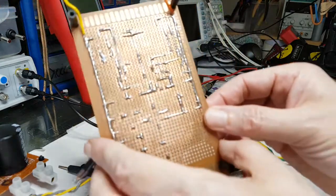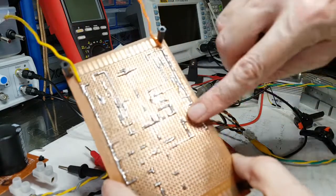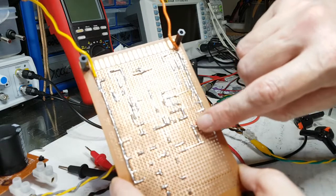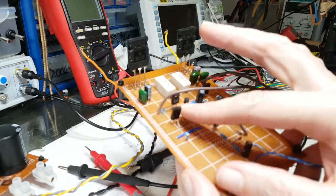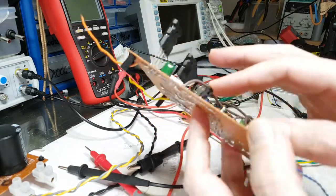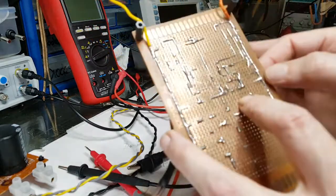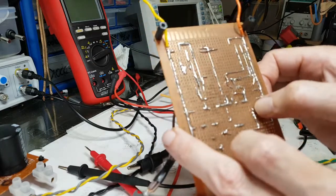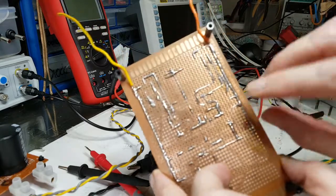And can you see that? It's just the lights. I don't know why I haven't soldered it as well as I should have. I don't know how that managed to come apart, because I didn't take this out. Oh, that's a bit of a lie actually. Yes, I did. I disconnected this because I tested it within the circuit by just disconnecting the leads, because it was easy to do that one. It was easy this one and this one, but I just obviously didn't solder that back down. I pushed it over but forgot to solder it.